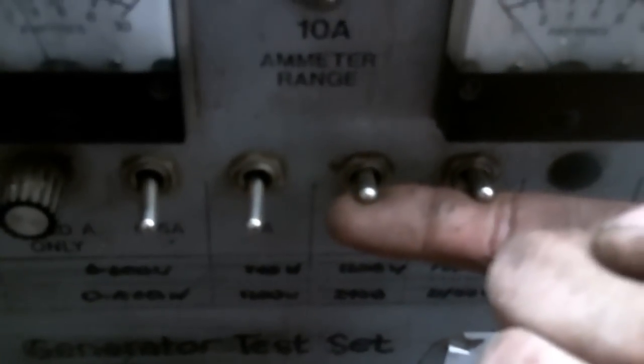As you can see, we're putting about 50 to 60 volts. Now you can turn this on and pull a load on it, but you're not going to be pulling full load — just half load. You can see you drop down to 60 volts. Since you don't have an AVR hooked up, you're just running raw voltage to the generator. You don't want to do this for a very long time.